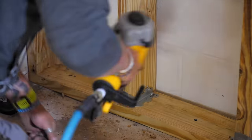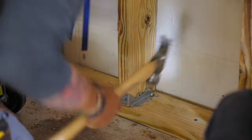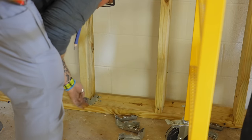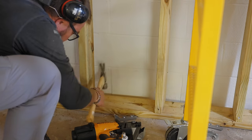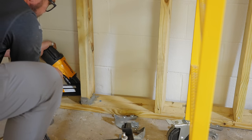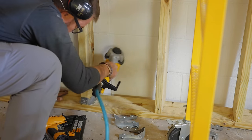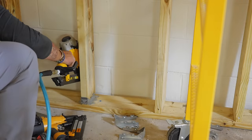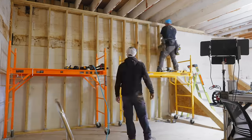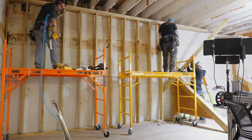The engineer also specified joist hangers at the top and bottom of each stud, and I was able to pick up a pair of metal connector nailers prior to this since we had roughly 180 joist hangers to install. Having two guns worked great — we kept one loaded with one-and-a-half-inch joist hanger nails for the straight connections and the other with two-and-a-half-inch nails for the diagonal connections. From there it was just rinse and repeat.